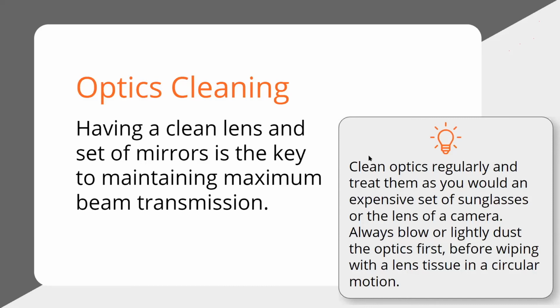When you take your lens out, that is the little lens caddy, the little red cartridge on the side of your laser head for the mirror. For the Novas, the whole bottom of the laser head just slides out. But you don't have to remove the lens from the caddy to clean it. You can clean it in there. It's usually the best way. And you just slide it back in.